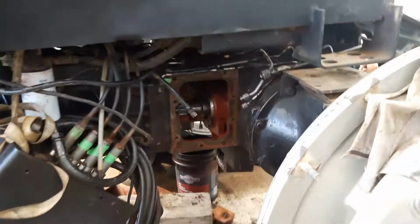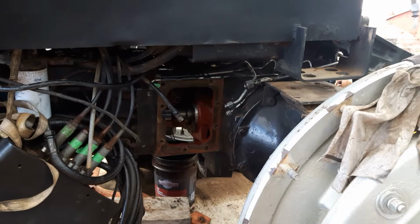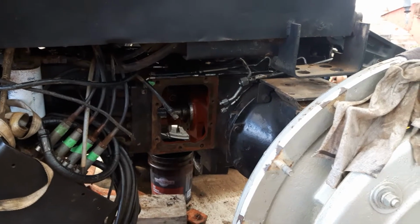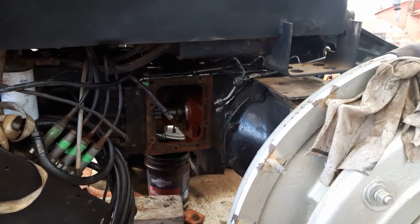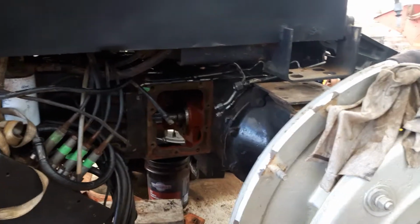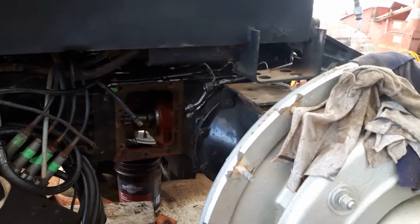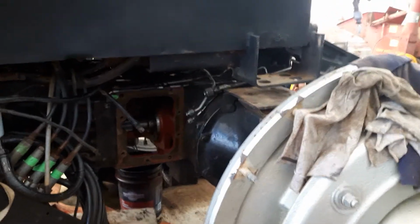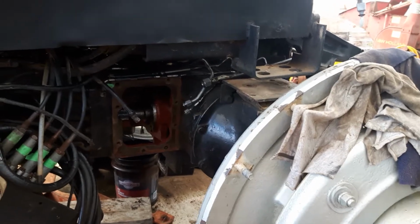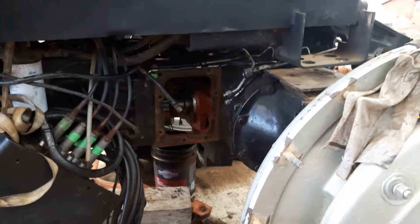Always something. There's a reason things are leaking. But I do know, like when I had the gauges hooked up to it, I had 250 pounds running in four-wheel drive, and it takes hydraulic pressure to disengage a four-wheel drive. So when you put it in two-wheel drive, I was losing like 25, 30 pounds, I believe is what it was, on the other end, so here she was really blowing by.